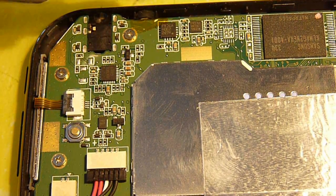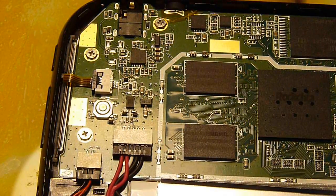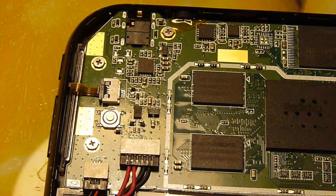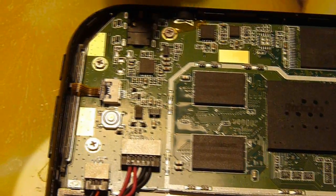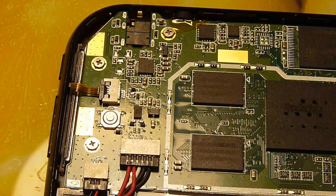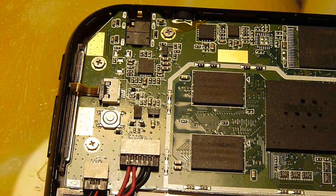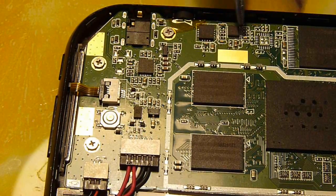At the top here we have where the microphone is — the one we want to replace — and the headphone jack. We've cut out a lot of the original motherboard overview footage, so we'll go over it again. Here we have the microphone which we've just replaced. Headphone out — this is a low-power stereo audio codec headphone amplifier, basically the chip that does the conversion, and it's also low-cost, which is what these companies like, especially on a budget tablet. We've got these two mysterious chips up here which we can't find datasheets on because of silly part numbers.